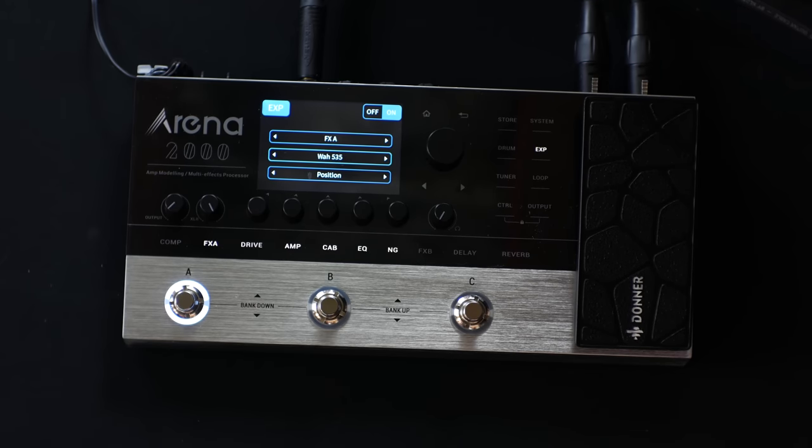Let me just give you some final specs on this and we'll call it a video. The sample rate is actually 44.1 kilohertz, the same as a compact disc. But unlike a compact disc, the ADA converters are actually 24-bit, not 16-bit. That's an incredible increase in dynamic range over what a compact disc can do. Think about that. The quality of this exceeds the level of a compact disc, which is just mind-blowing.